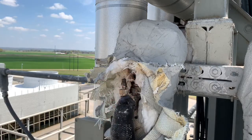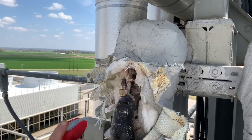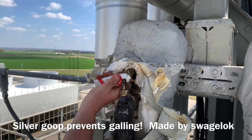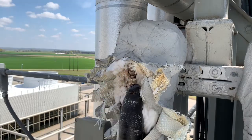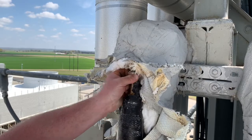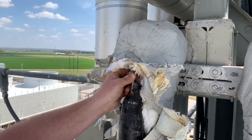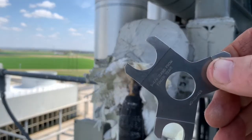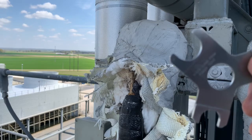I'm going to spray some WD-40 just to clean it, then I'm going to use some silver goop. On the back of the go no go gauge it says one and a quarter turns from finger tight.